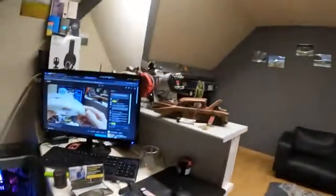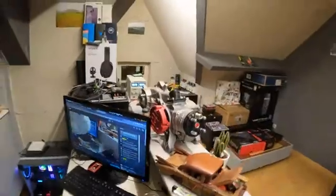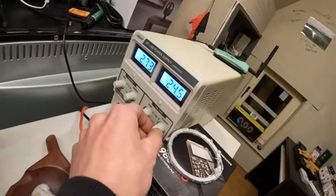So yeah, it lights up the whole room. It's really amazing. It gives off a lot of light. I used to have these cheap LEDs here, these ones, but those are nothing compared to this at 24 volts. So you see, this is the brightness now. When we go down, now we're at 20, now we're at 18 volts, now 16 volts, 15 volts. So yeah, even at 14 it still gives off a little bit of light, so you'll also be able to dim it or make it do fancy stuff like this by changing the code in the computer.